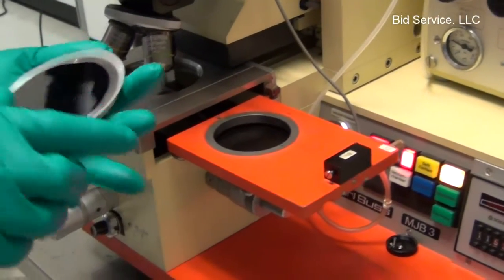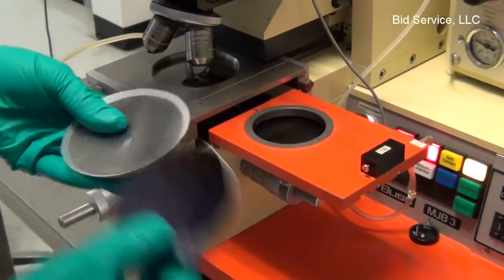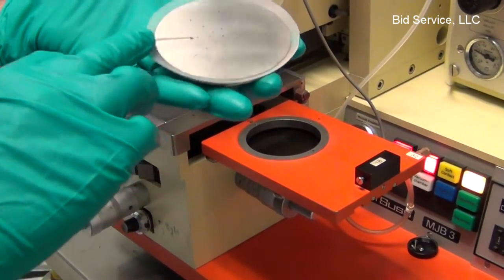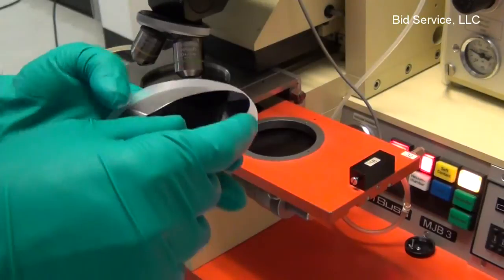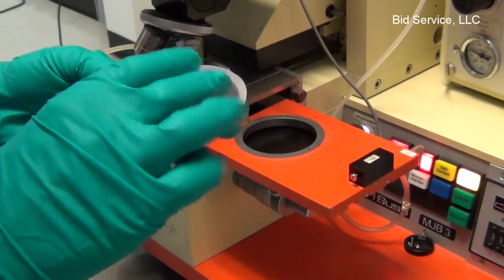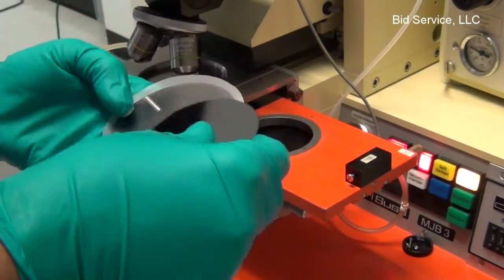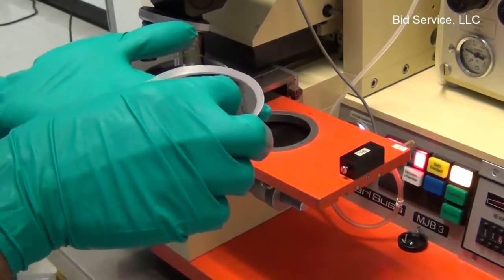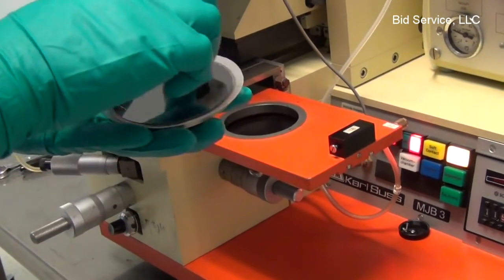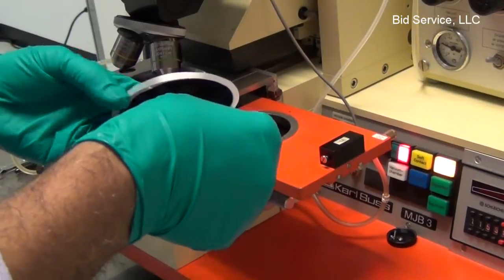And here's the substrate holder for 3-inch wafers. And the substrate holder has a silicone gasket here, which enables you to use this chuck for HP mode, where there's a vacuum contact generated between the substrate and the mask, using the sealing surrounding it.